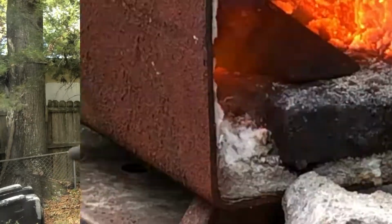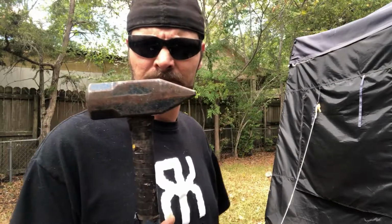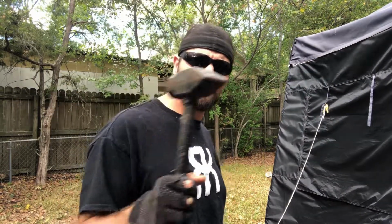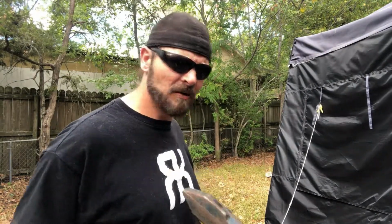So let's get the forge heated up. We're gonna toss this in there, and then we're gonna start beating it up. Alright, so what we're going to do is start with our big hammer. We're going to use this end here to try to draw out that wider end of the wedge, the impact side. We're going to try to draw that out and give us a little bit of a flap so that we can work it out to make our axe head, or our face, I guess it's called. But got to use a big heavy one because it's a lot of metal.